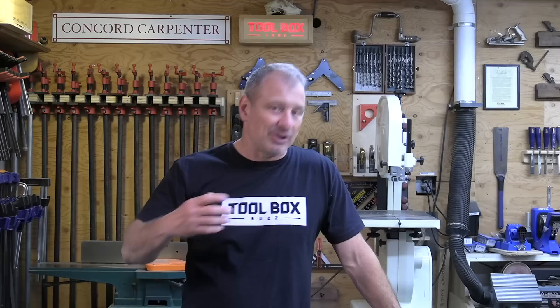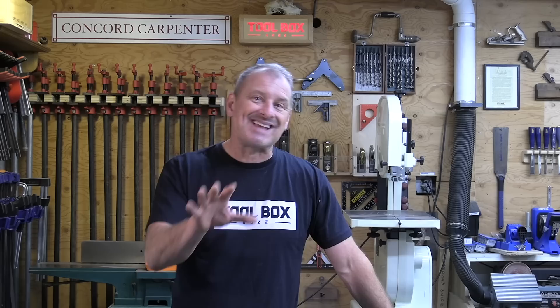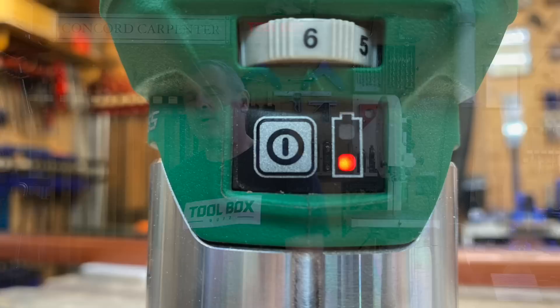You do notice that two and a half pounds when you're using it. It's a brushless router — lightweight and pretty compact as well. I ended up using it with a larger battery, but you can absolutely power this thing on a 1.5 amp hour battery and bring that weight way down. There's a two-power safety switch: the first button turns the power on to the tool, the second button allows the router to turn on, and there's a 10-second timeout between the two pushes for safety.